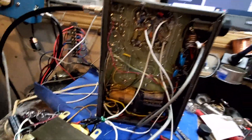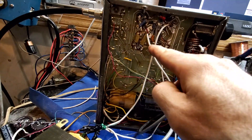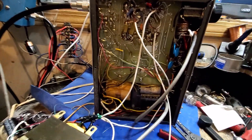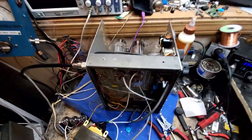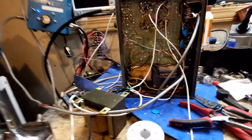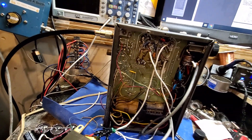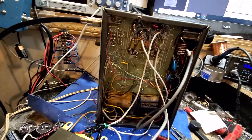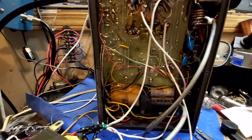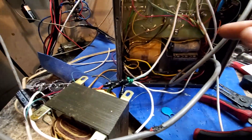Once I get this wired into those three tubes, with the transformer mounted in the back and new high-voltage circuit mounted up top, it's all going to be nice and neat. He's going to have a single tuner on the front for his drive, rocking all that swing into those three tubes. This little 250 — that's out the window. Now it's time to do the hard work. Our driver works. We now have a single 6LQ6 driving three 6LF6s, and we are not taxing any more transformers.